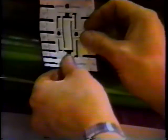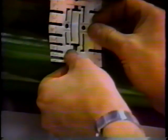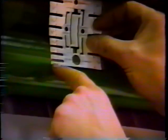Again, we'll let our press run. Get rid of the old stripe. Distribute the ink, and we'll check it one more time. Stop the press. Wait a few seconds. Inch or reverse, as the case may be, until we can see the stripe. All right, now we can see that we've got a real even stripe the entire width of this particular roller. We can use our little gauge here to tell exactly what we've got here. And I would say that's about a 3/16 of an inch stripe.